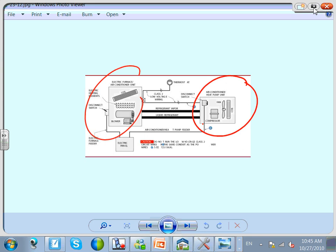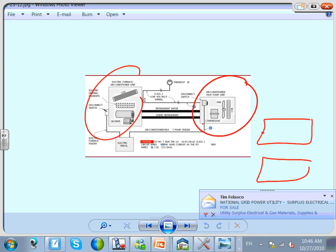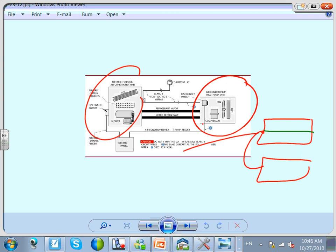So using a baseboard heater to pull your wires to go to another receptacle or baseboard heater? No, you can't do that, unless the equipment is listed as a raceway. And it's not a raceway, even though they can pull their wires through there. Dedicated wires for them, but they don't pull the wires through. They pull the wires for the equipment. They don't use it to go from one to another. See how his baseboard heater one, his two, they come from J box to J box and out. They don't go this way.